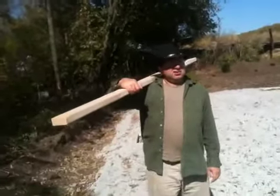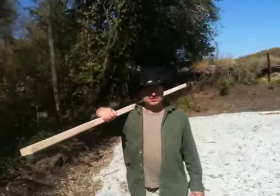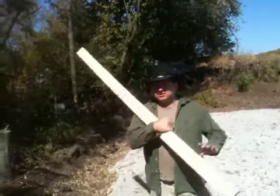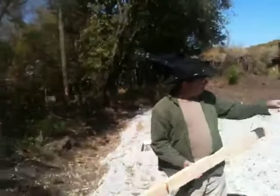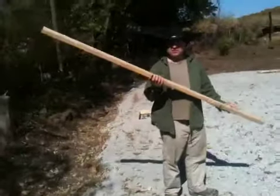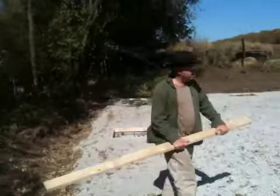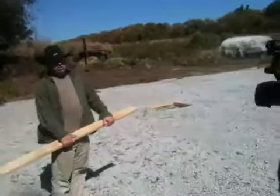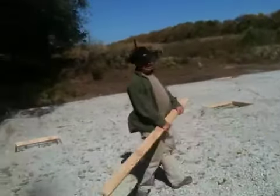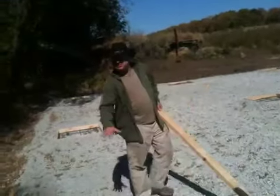It was about 12 foot one way and 20 foot the other, and the screed was about 16 feet. You need some room to jiggle it back and forth. These seven-footers give you lots to grab onto. So we're going to start going around, pouring these and screeding them off, and behind us the first one will start setting up because it's been sitting there for a while.